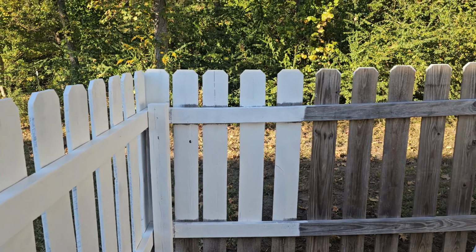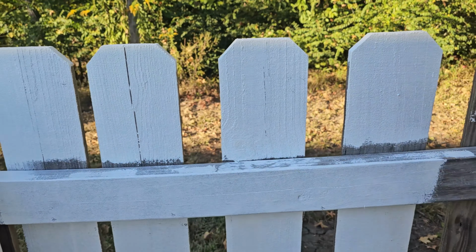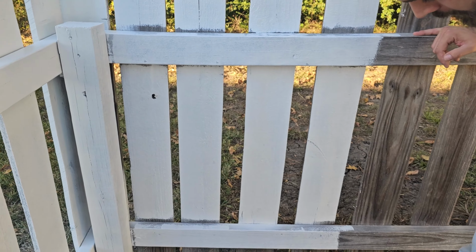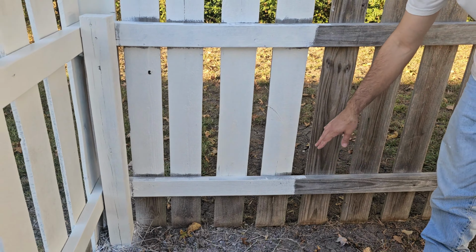As you can see, my wife can help me get a little bit closer. You've obviously got all these cut-ins, and especially on the corners and stuff. And then the bottom, you see, I didn't even bother using the roller there because I'm gonna get so much nasty stuff on my roller, and that's a no-no. And then it's a little harder to see, but these edges are dry. And so the alternative would be to go in there with just a little paintbrush and do that all day.